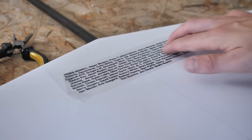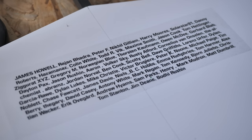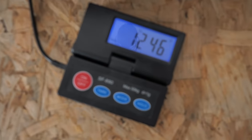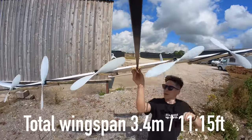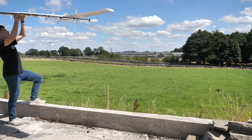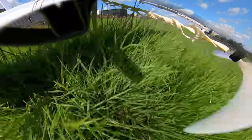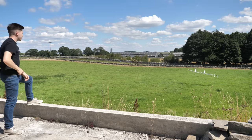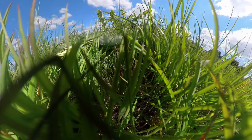To finish the build I added my Patreon supporters' names to the tail. But would the plane be light enough to fly? For a model plane with this wingspan it was seriously light. For the first test I wasn't going to wind up the motors — just throw the plane to check balance. A nose dive would mean it's nose heavy; pitching upward means tail heavy. Balance is the key to flying machines — everything needs to sit happily together for stable flight. My plane was designed with no control whatsoever, relying entirely on inherent stability, so a few test glides were the best way to assess that.